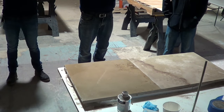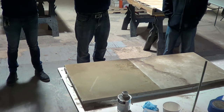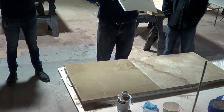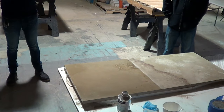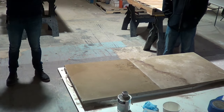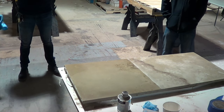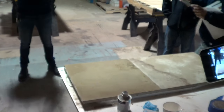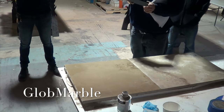Yeah, that's why you let it do another. All those pinholes, when you're doing the PC-12, it's hard to get rid of those pinholes. So when you're slurrying it, you want to make sure you cover up all those pinholes so that they don't come back each time. But with the next coat, they'll probably still come back.